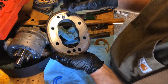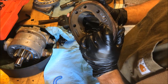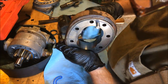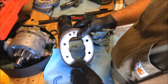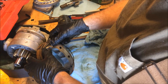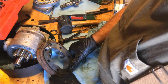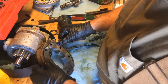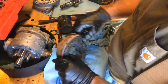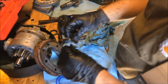I took and cleaned this all up. There's that little black rubber seal that goes around there — but that didn't come with my kit, which surprised me a little. I got this kit on eBay and the guy said it was the complete kit. Usually when you replace seals you replace all of them. So I'm going to do the major sin here and use this seal again. It's rubber, not plastic or Teflon, and it looks like it's retained its shape. I bet somebody out there is saying you can't do that — well, that's what I've got, so that's what I'm going to use. One thing's for sure: it can't leak any worse than it did when I took it apart.